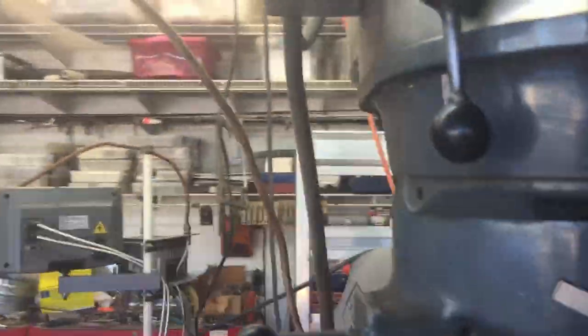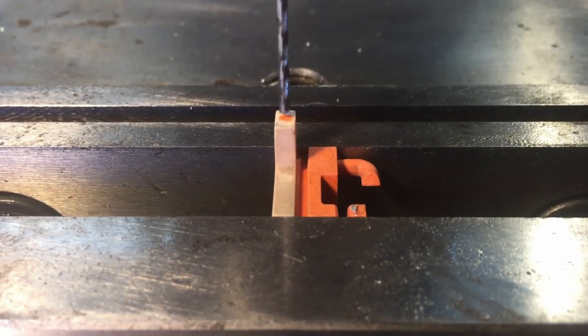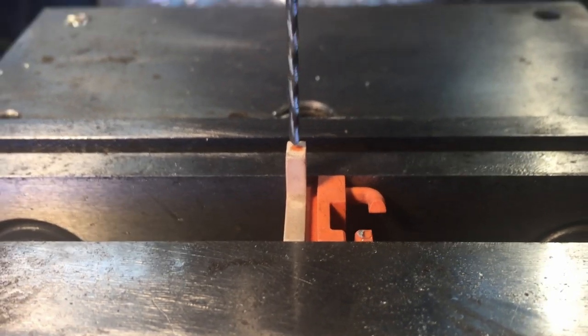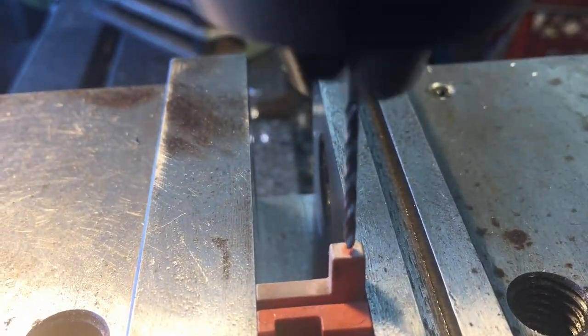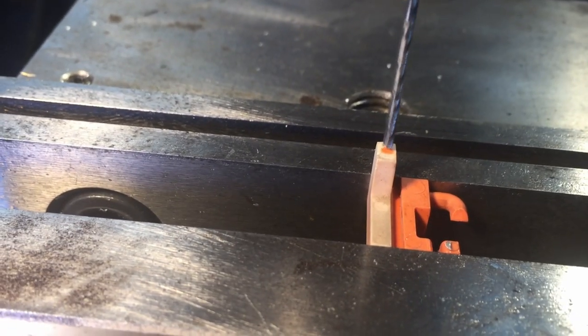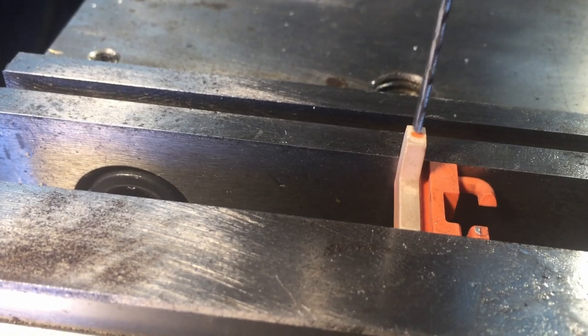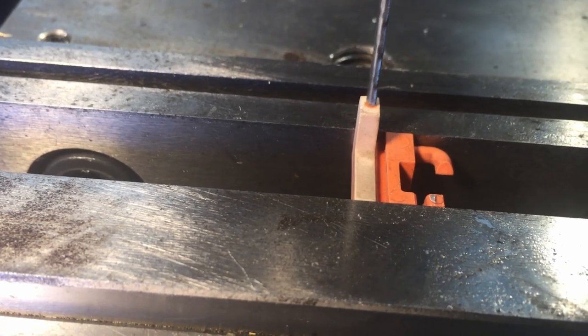Now I can flip the handle up on this guy. It's easier to see lined up while it's spinning. There's a little bit of wobbling; you can better detect it. All right, I like it. Let's see if we have luck with this, and the bit doesn't wander. I do have starter drills, but I'm too lazy. I think we'll be fine. If it wanders, lower it really slowly.